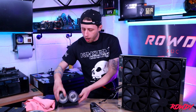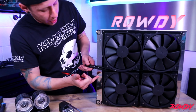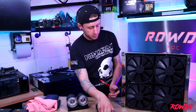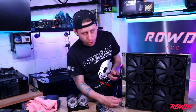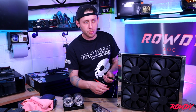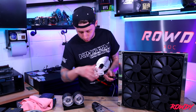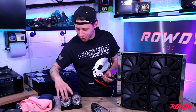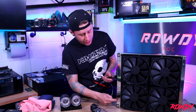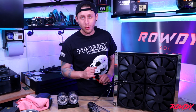And then on the pumps, for the bracket for this, I had to use one of the additional bolt holes that would have been used for this, because this normally sits centre, but obviously I'm using it up higher. I've had to tap one of the bottom holes, which are just a hole, there's no thread there, and you can't get in there to put a nut behind it. So I tapped that to an M4 so I can actually utilize that as a fixing. I could not have done this on just one bolt, so this very much needed two. It's basically making use of the one M3 and then tapping that up to an M4, and technically this should work, but we'll find out, won't we?